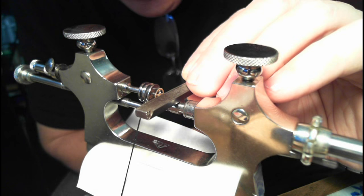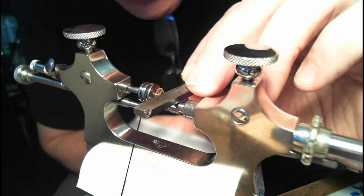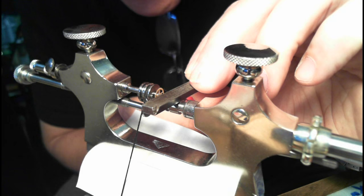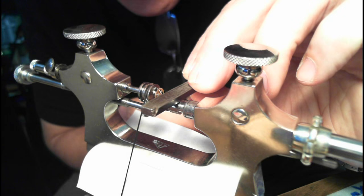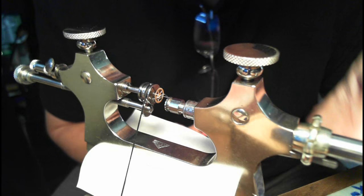I'm trying to move the file. And I do not have the touch yet. I've just started doing this. So it's brand new to me, but I was kind of peeved that nobody had put anything on the internet on this. I looked everywhere and the information is 0.0. And that smoothens out the edges, because else this pivot will slip into a jewel hole. And if it's not smoothened out, then there'd be friction. And if there's friction, then there's a problem. So I've polished the edge there.